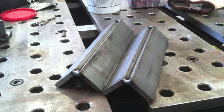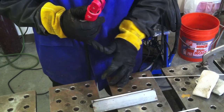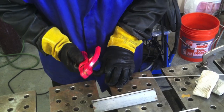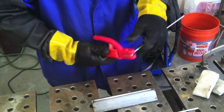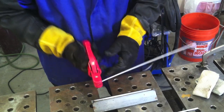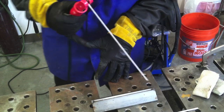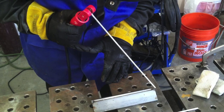I'm welding outside corner joints today in quarter inch flat bar, and I'm just going to lay them down flat. I usually use this little pinky-to-thumb collapse technique to prop and steady up with. It's comfortable and it works pretty well for me, and usually when I'm welding flat like this, a lot of times I'll bend the rod a bit backwards in the stinger — it just helps me keep the right rod angle.